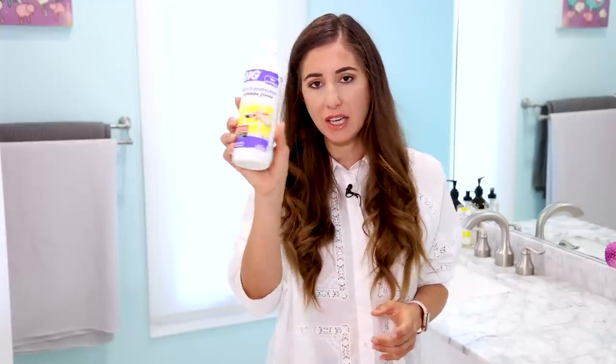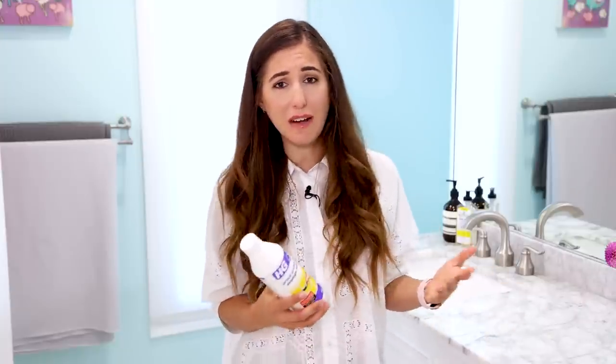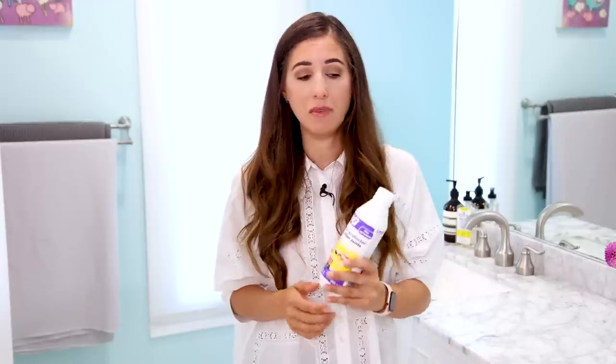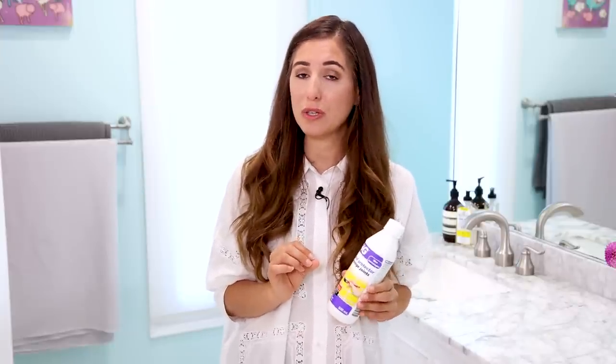Where there are tiles, there's grout, and where there is grout there are stains — something that drives people in the Clean My Space community absolutely crazy. Over the years we've shared many ways to clean grout, but never about sealing it. Sealing creates a clear gloss over the grout so it's no longer porous or absorbent, meaning soap scum, dirt, and stains can't actually get into it. It takes a little preparation and time, but if clean grout lines matter to you, carve out an hour or two — it'll be worth the effort.